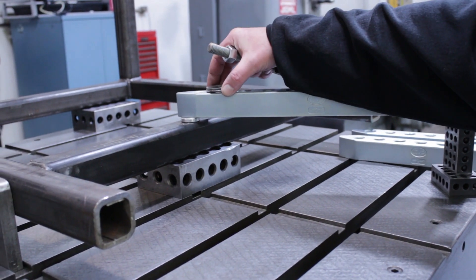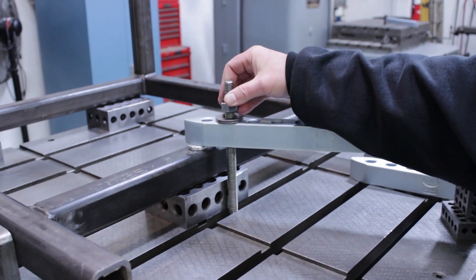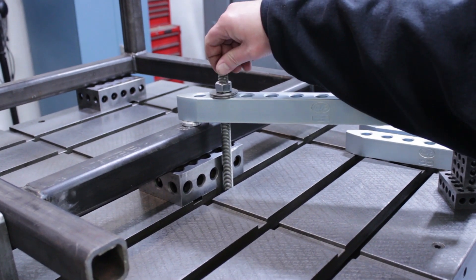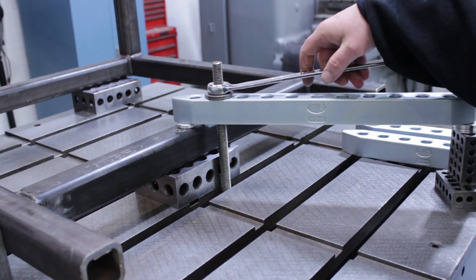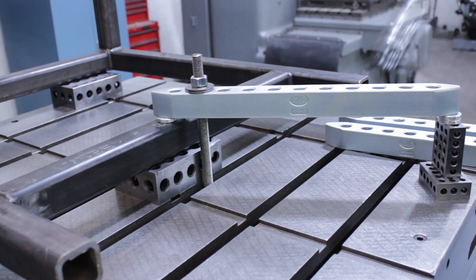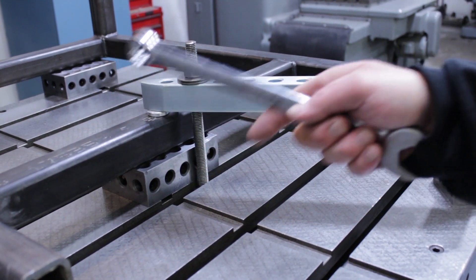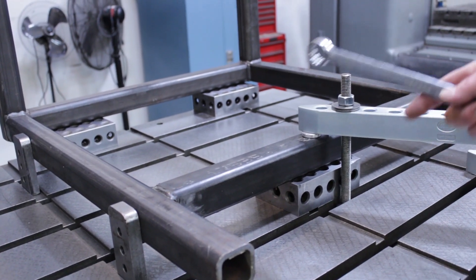Now I'm just going to throw a couple of washers on top of the clamp and install the stud. The T-nut is already down there. Tighten up the clamp — we're not going to make this one super tight because we're not really doing much work back here. If we were milling or doing something heavier, we'd obviously set this up a little bit differently. Most of the pressure is going to be up front. We're going to install two of the eight-inch clamps on the front blocks.